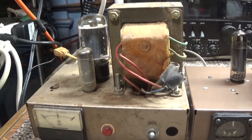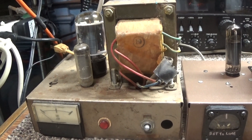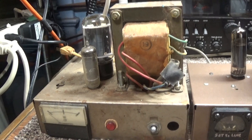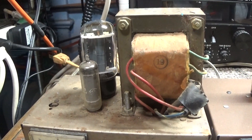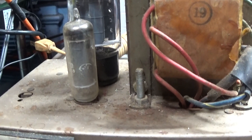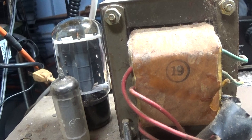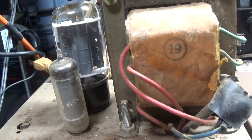That's a JB 150. To show the difference between the JB's, it has the big tube, and the older version had the smaller tube to key the relay — so that's the keying to the small one and the 8417 or 7581 big tube for the final.